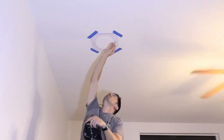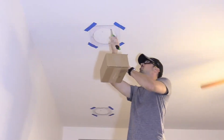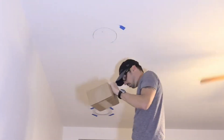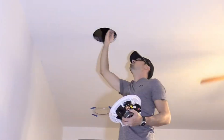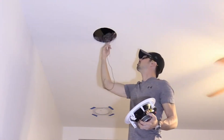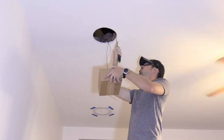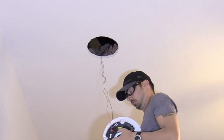I'm tracing out the area where I'm going to cut. Make sure you're using a sharp drywall knife — a dull knife will be torturous. Use the right tools for the right job. I'm using a box to catch all the debris; there may be some insulation that falls in as well. Trim out the outside of the area so the speaker can slide in.